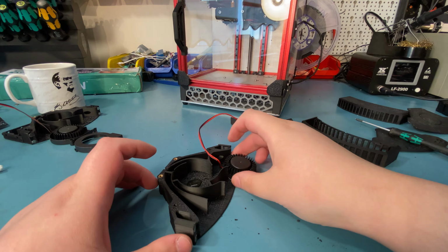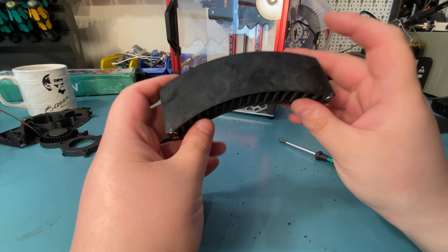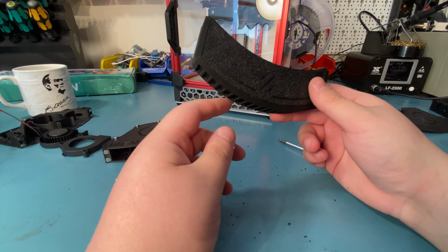This side, the filter cartridge side, you need to fill this with the pellets. Don't use granules or anything, they're too airflow restrictive, so use pellets. The reason I don't have them right now is, well, if you watched that video you already know I don't have the correct type that is acid free, and if you use active carbon that's washed with acid or activated with acid, the results are terrible. For more information you can check out that video, but yeah, for now I'm going to just assemble this like this, and the actual testing of this will be after I move.